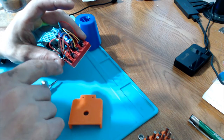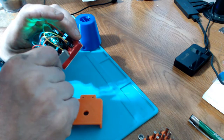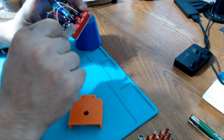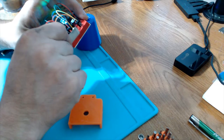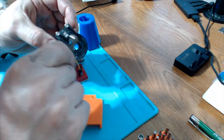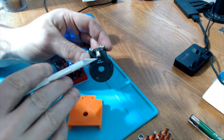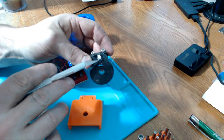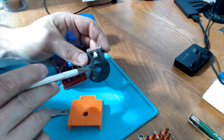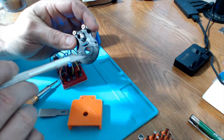The other thing is: I bought clear LEDs instead of frosted ones, which is a bit of a mistake because that doesn't mix the colors as well. Also, I'm only barely getting overlap between each of the colors with this spacing — and this spacing is a little less than the spacing on this guy. I can bring the spacing closer by flipping the Hall effect sensor mounted to the PCB upside down to get it closer to the center circle.